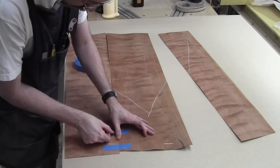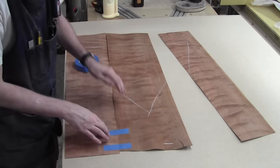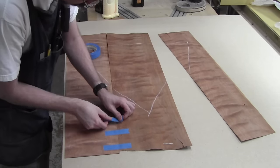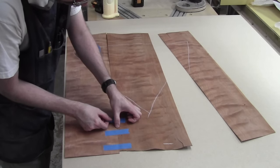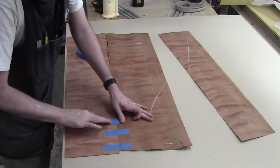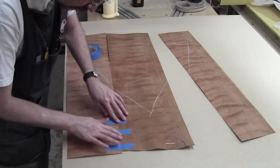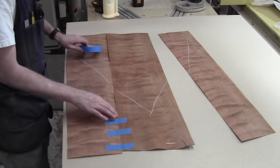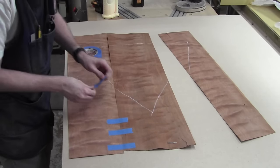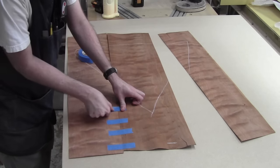And we're doing this dry first because I'll flip it here in a minute. And we'll put the glue on the other side. And this pulls everything sort of together in a nice fashion. And this is how I do book matched or edge jointed veneer.